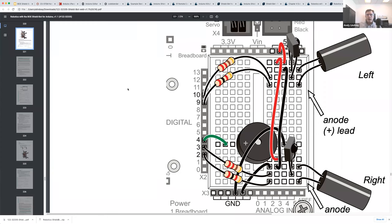But also we add, usually wherever possible, some troubleshooting tips saying, if you don't see that one turning to a zero when you push the whisker up against the post or when you put your hand in front of the IR detector, go back and check your circuit because there may be a mistake there. And also when hand entering the code, there may be a mistake there. Those are things that we talk about peppered throughout the book to help them get used to troubleshooting their circuit and their code, because it's pretty much inevitable. And it's actually a habit that those who go on to do this kind of thing professionally will be very glad to have picked up at an earlier juncture like that.